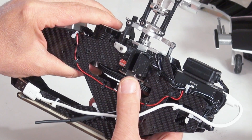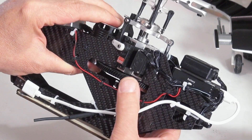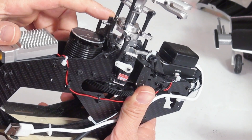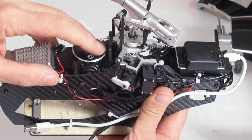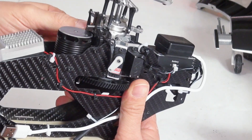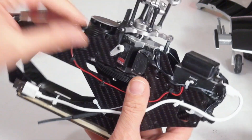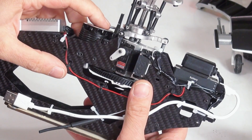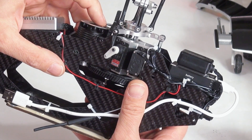Then just spin it around and make sure you have this tiny little tick. The only other thing is a 3D printed anti-rotation bracket here, which goes around the motor. But there is enough space — even under maximum negative — the servos physically can't go anymore, and there's still space here, so there's no chance of rubbing against the motor.